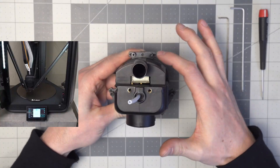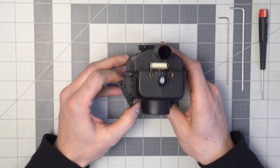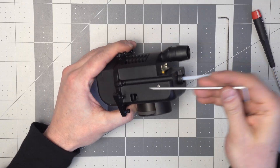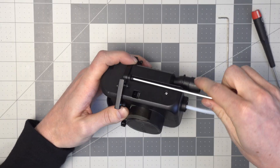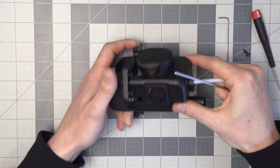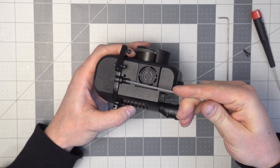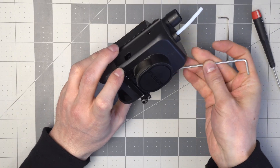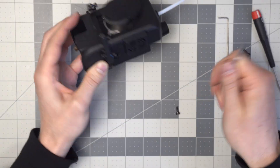Usually this would be attached to these three points with these 12 screws which we've removed from the arms of the Delta Style printer, but usually you wouldn't do this. You would do this next portion instead if it was on your printer. So we have these two screws — one here on the side where you have a nice slot for the tool to follow. You can remove that screw, and then on the other side they don't have the same feature. There's a fan in the way so you have to go in at a bit of an angle and remove the shroud that way.